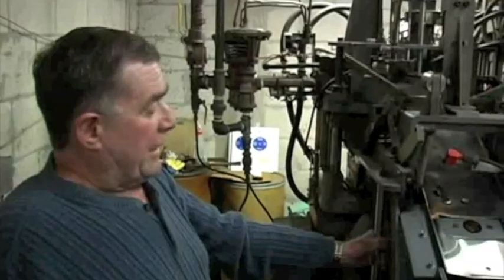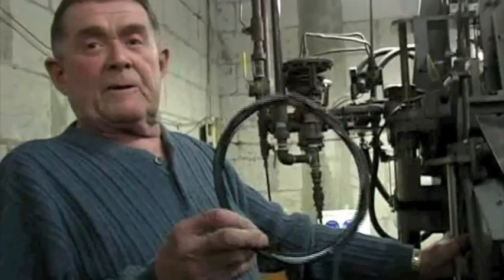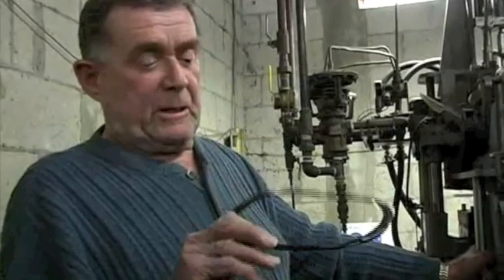The press closes on it and the record is molded using steam heat in excess of 300 degrees Fahrenheit. After several seconds of heating, it's cooled with cold water. As you can see, it comes out of the press. Before that happens, the outside diameter is trimmed. That outside flash or excess material looks like this — makes a good halo.